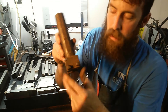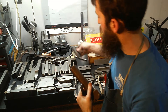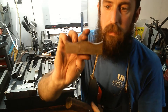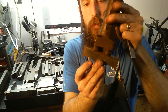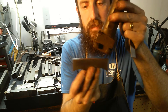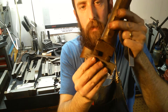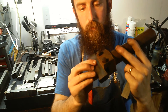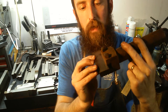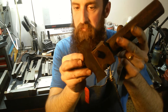Here's one that's beat up, but it's still a good tool to have. It would hold a profiled cutter — bolt it in there if you wanted to make a profile. This is probably too big to use in steel; the shaper may push it and you'd get lots of chatter. But in plastic or something, it'd be great.